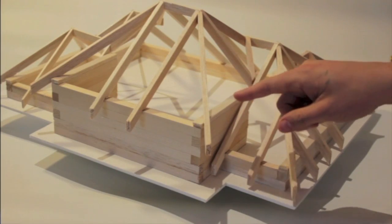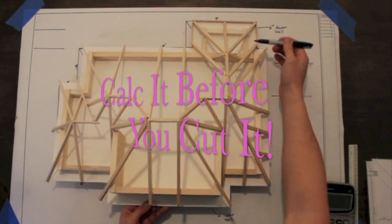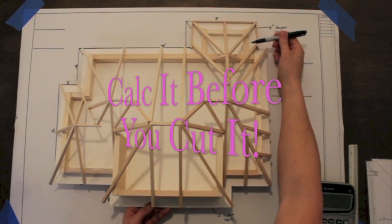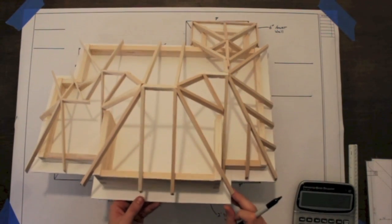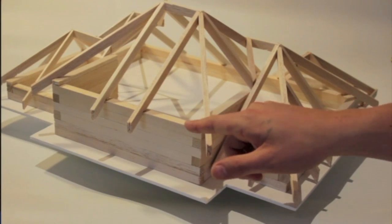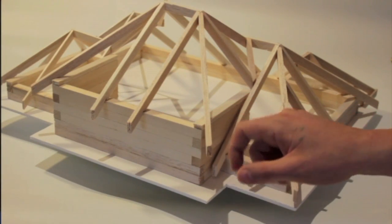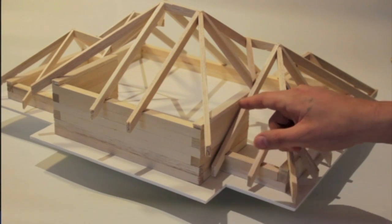You can see the raised plates, and we're going to show you how we come up with heights on those and what the offset of the hip is going to be. We're also going to show you for our valley rafters where we have different plate heights. And we're going to break all of this down in the office before we ever step foot back in the field and start cutting. There are also multiple plate heights that are a two-foot height difference, and we're going to show you how to calculate those.